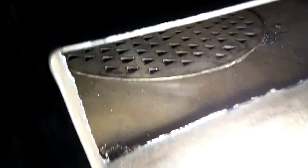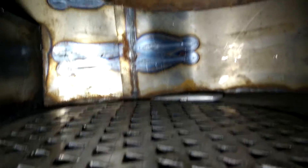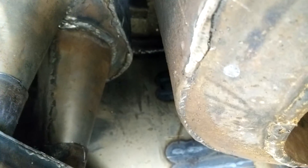This is the main ash dump. You can see very nicely into the bottom of the gasifier here — there's the grate. You can see that box, the bottoms of the two cyclones, the cyclone jacket I was talking about, and then of course the bottom of the fire tube. If you look, you should see the plank.